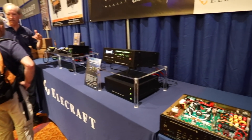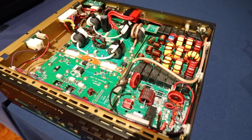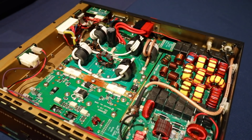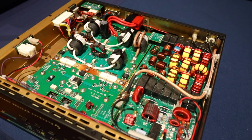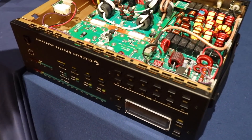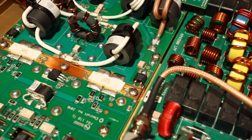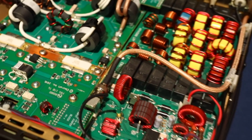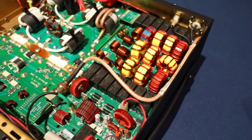If you take a look at the inside of the amplifier here, this is the RF deck with the amp turned upside down. On the left side are the RF transistors — we're running two 1400 watt transistors, each capable of putting out 1400 to 1500 watts. The heat dissipation is 1400 watts apiece, giving us 2800 watts of heat dissipation — almost double what we need. They're mounted to a copper heat spreader, reflow soldered onto it, bonded to a huge heat sink cooled by fans from the back. On the right side is the low pass filter and pin diode TR network — no transmit/receive relay, all solid state, so it's silent going between transmit and receive.